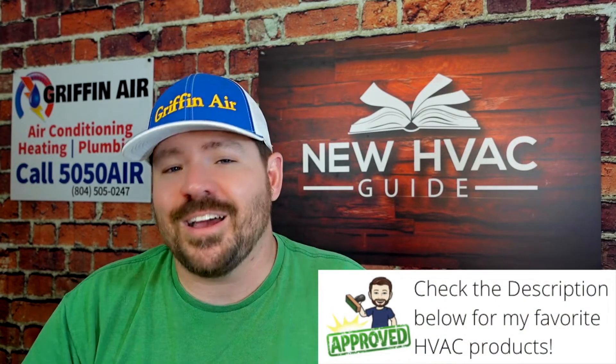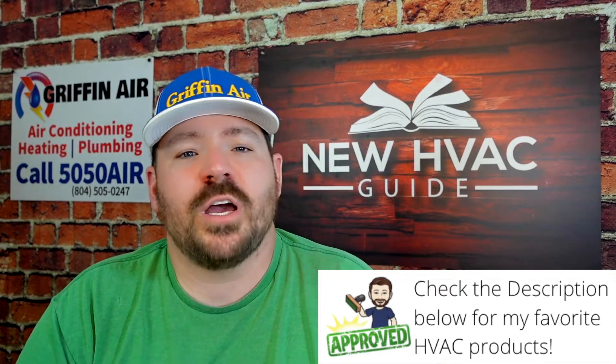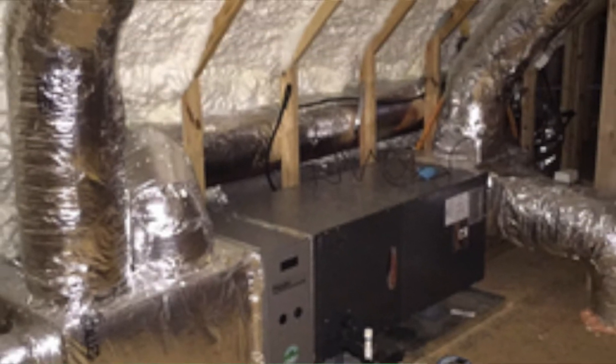Keep that in mind and get their opinions. But if you have ductwork in an attic, we have attics here in Virginia that on a hot summer day can get way above 100 degrees — some above 150 degrees — and my guys have to go up there for repairs. We love a conditioned attic. When someone conditions their attic and their ductwork runs through there, it's no longer sitting in that hot oven. Some attics feel like you could fry an egg in them. When you condition it, the duct doesn't take quite that abuse and the R-value doesn't necessarily have to be as high.